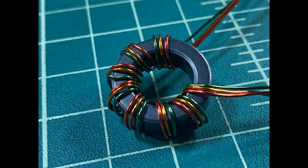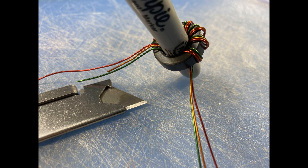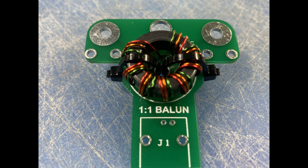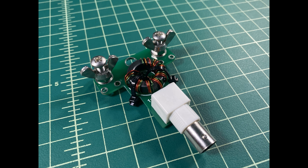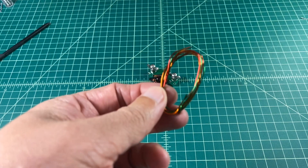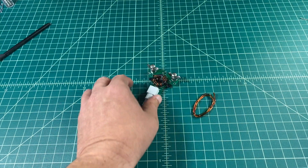Here are a couple of shots from the build. The toroid is wrapped with wire and it doesn't look too bad. I used a Sharpie when scraping or sanding the enamel wire down — it held everything in place and made the job a little bit easier. I'll tell you, cleaning the enamel off those wires was a total pain — difficult, difficult, difficult. I did have some enamel wire left over that I might use on a different project, but I'm not looking forward to it.